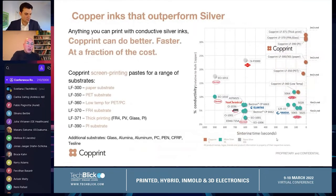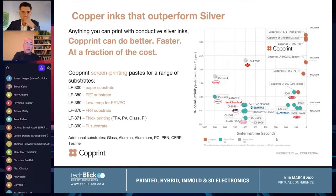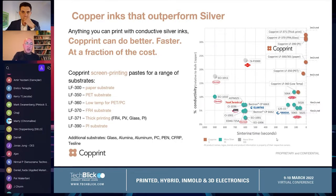Going into more comparable data: at Copper Ink, our inks — you can see on the right-hand side — the Y axis is the conductivity, and the copper inks have higher conductivity than the silver inks offered today. They also have a lower cost, which provides that factor of five to ten in cost performance. The processing of the copper ink is also much faster, making them suitable for high-speed roll-to-roll processes for printing on flexible substrates. We are also enabling printing on rigid substrates.